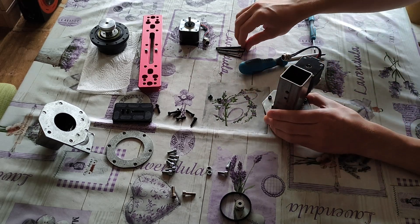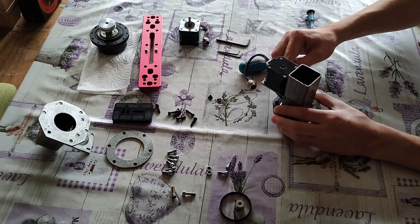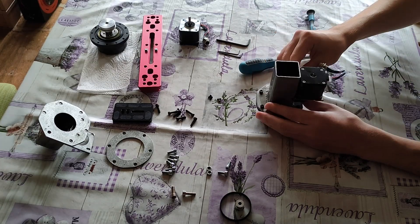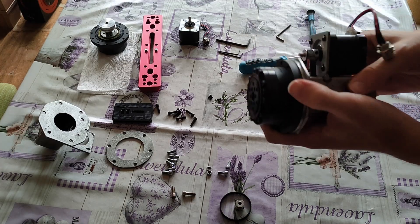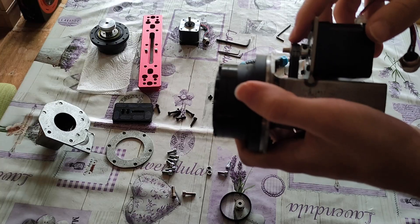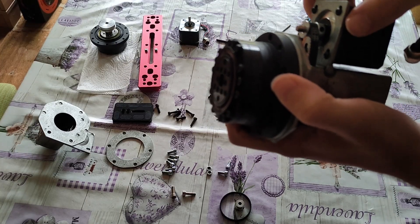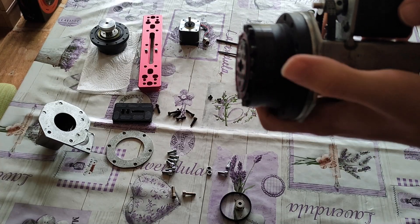Once the harmonic drive is on I can start tightening the screws to make sure they won't come off. The last step is basically aligning the two gears together - the inside gear and the small gear on the motor - and then adjusting the belt tension by adjusting the height of the motor. I'm going to do that once the mount is fully assembled and the declination axis is also on.